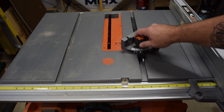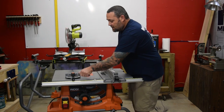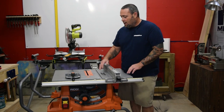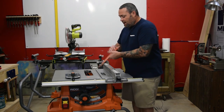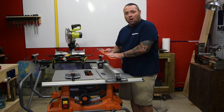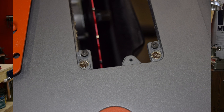It has positive stops and adjustments for you to make to bring everything into line. The miter gauge was out slightly — no big deal, no harm there. I'm actually going to probably build a sled for it. The slot is an open slot that'll allow you to use a thin kerf or a thick kerf blade. It has adjustments built into the bed and magnets built in that lock it in as well.